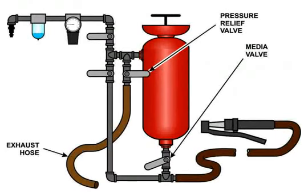The pressure relief valve is an addition you should make to facilitate depressurizing your pot when you're through using it, or when you need to load more abrasive into it. Many pots come with a small brass pop-off valve that usually has a wire ring on it that can be pulled to open the valve.